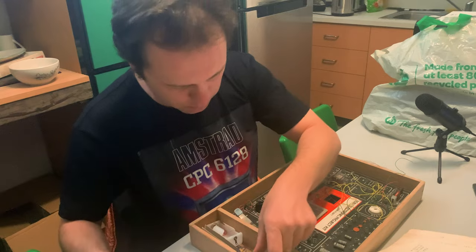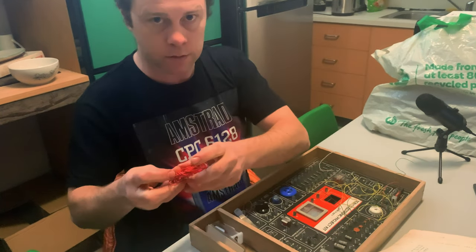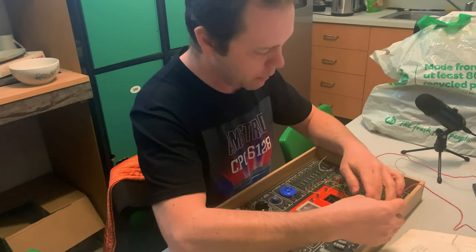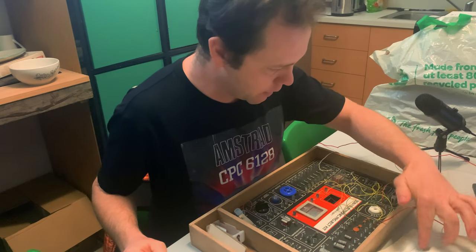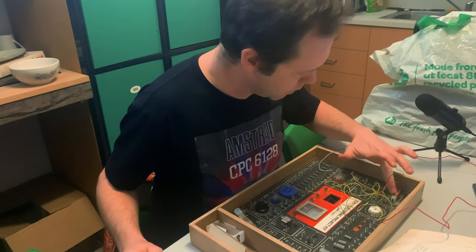So I'm just looking for the longest wire that I have. From our capacitor we now go to the antenna — this is the longest piece of wire so I'll use that. All right, let's check: we have antenna to 17, yes. 18 to 5 to 2, yes. To yes, to yes, okay.